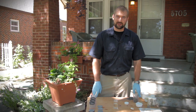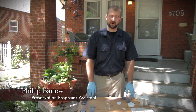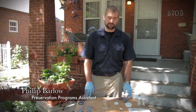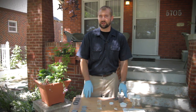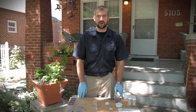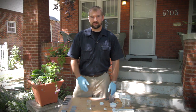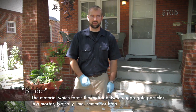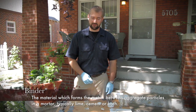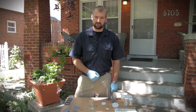Let's talk a little bit about mortar analysis. An analysis can be a great way for you to find out more about your home's mortar before you decide to start a repointing project. Typically when you have an analysis done, you'll send this out to a professional lab and they'll send you back a report that'll tell you the different sizes of grains in the aggregate, the ratio of the aggregate to the binder — which would be a lime or a Portland cement mix, and sometimes just lime alone — and basically a little recipe for how you can try to match the mortar in your home.